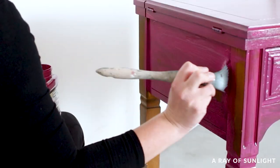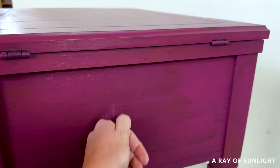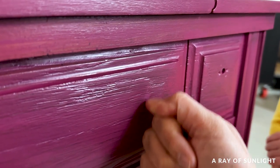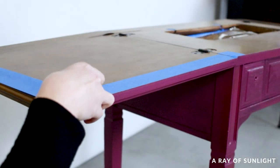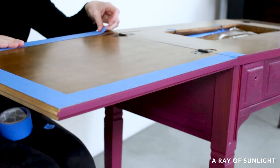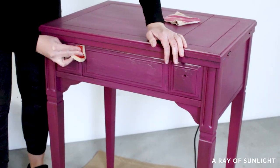It worked well on the flat surfaces as well. It took me about 20 minutes to paint this little table, and then I let it dry. When I came back, I did a little scratch test and it seemed to hold up really well, even on that plastic laminate front. I taped off the inside so I could leave the interior wood unpainted — whoever sews at this desk will probably have needles that could scratch up the paint, so wood is a better finish there. The paint felt a little gritty, so I sanded it all with a fine grit foam pad to remove that slightly gritty texture.